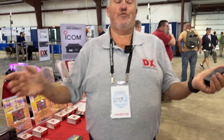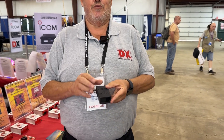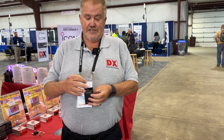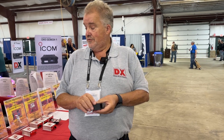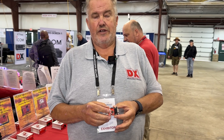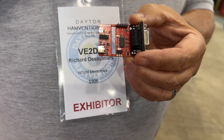Finally introducing some Kenwood products. The KIB-1 is a breakout box similar to the IAB-3-Dual on ICOM — it takes in the accessory connections from Kenwood radios and outputs to simple-to-use 3.5mm jacks. Also for Kenwood and Yaesu is our new YK-1-BT, which is currently a prototype being finalized. The YK-1-BT is an RS-232 to Bluetooth interface — small and simple — supporting any RS-232 male devices.